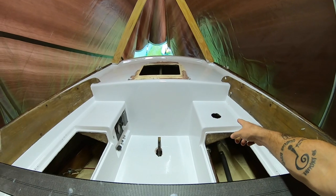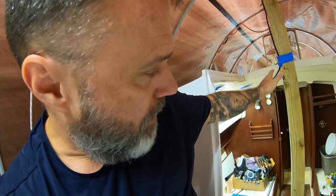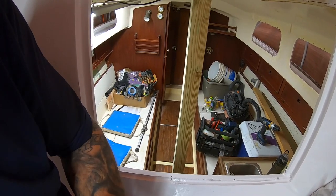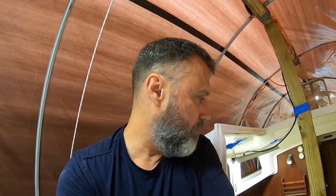I'll work on those hatches over the winter along with some other stuff. I've got a hand bilge pump that I bought a rebuild kit for and still need to do that. My original plan for the boat was to start at the top, get it watertight, then go down to the bilge. I need to open up the bilge all the way, clean it up, and seal it — because I had water infiltration in the encapsulated keel that caused a freeze-thaw crack in the keel. I'm trying to eliminate any way for water to get into that keel. So next up is opening up that bilge. Thanks for watching!